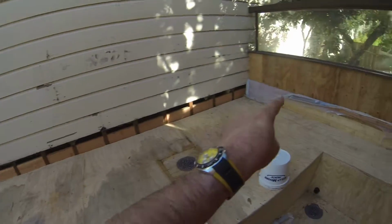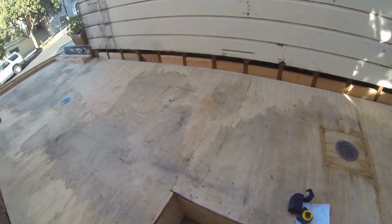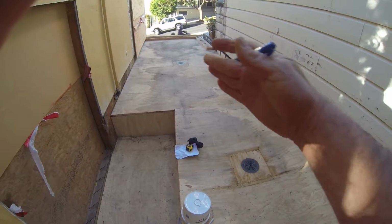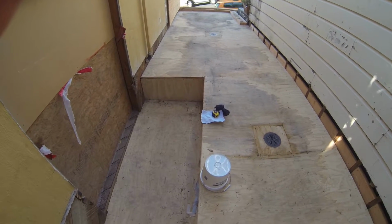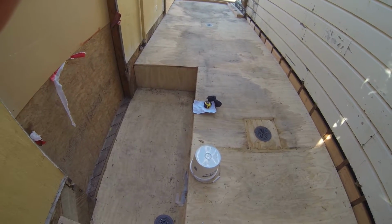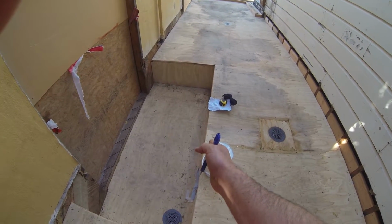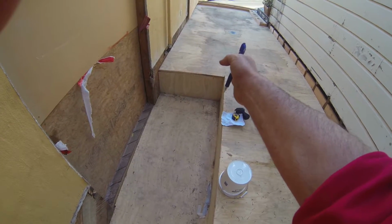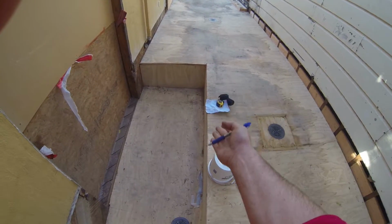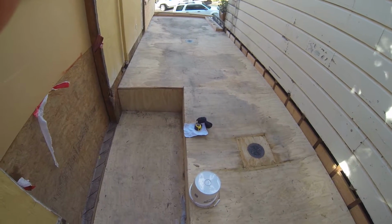So again, from end to end, it's about 26 feet, including the uplap. The width from this wall to here is about 5 feet, so this can be the first strip that comes down, and you can see that the deck is somewhat pie-shaped. It comes in at an angle like this, and I'm figuring when you run your first piece of Duradek, I'm just trying to think if there's a more logical way to do it, is you can follow this line and or the seam line probably over, just follow it parallel over a few feet, or maybe actually make the seam line exactly where this is, so it lines up with this, but that's not going to work with the material overlapping over here. You'll have to give it some thought and think about how that layout works out.